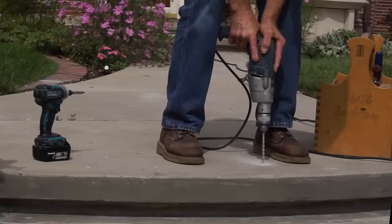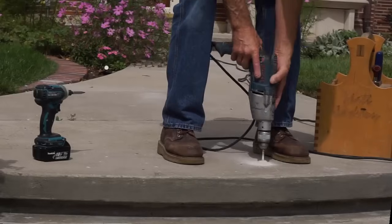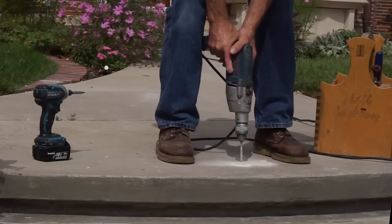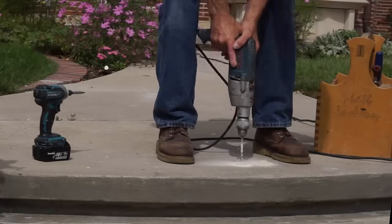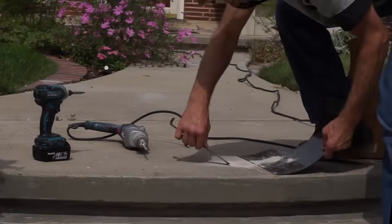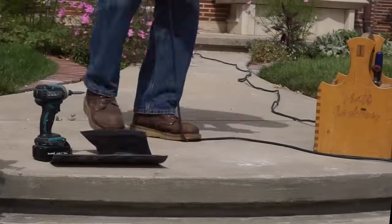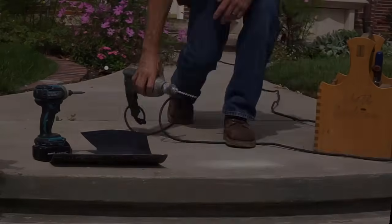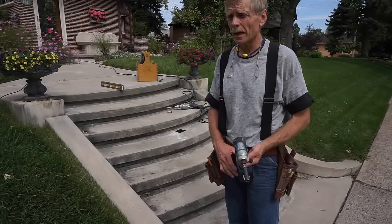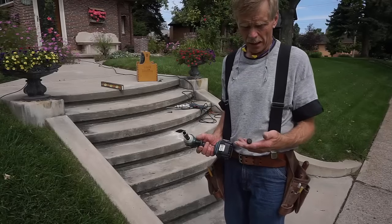After drilling out the holes, just clean away excess dust and double ream the holes to make sure there's no powder built up in the bottom. With my 6 holes laid out and drilled, and the holes cleaned out, it's just a matter of placing the railing and driving the LDTs.